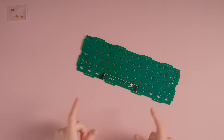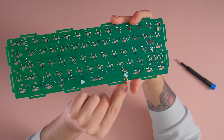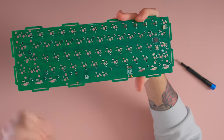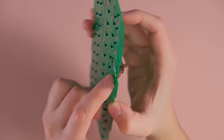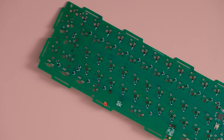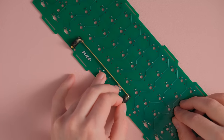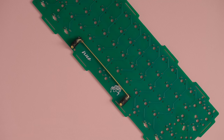Next up, we're going to grab our screws and washers. For the sake of demoing on a thinner PCB, I've screwed this all the way in without using a washer or riser — and you'll notice there's a bit of wiggle. That's because the thinner PCB absolutely needs that washer to help bridge the gap. On the other side where we install the washer, there's absolutely no wiggle or jiggle because we've used the washer plus screw. Some thinner PCBs won't even allow that and may require a stab shim or riser, but usually a good washer will eliminate the need for that entirely.